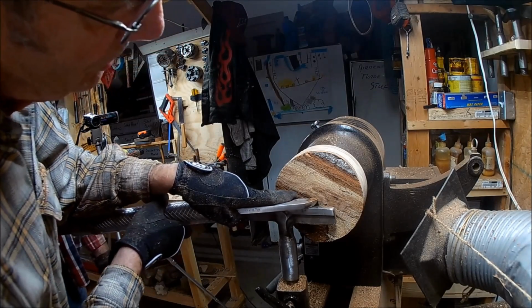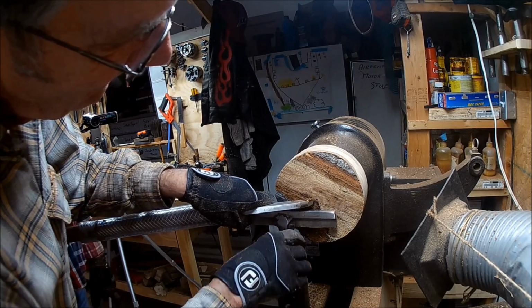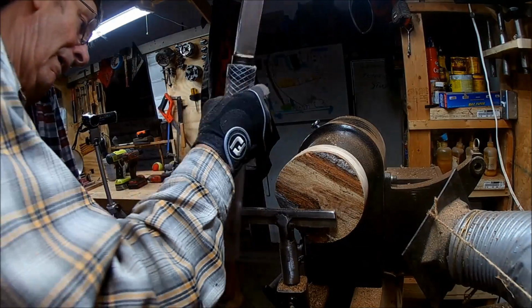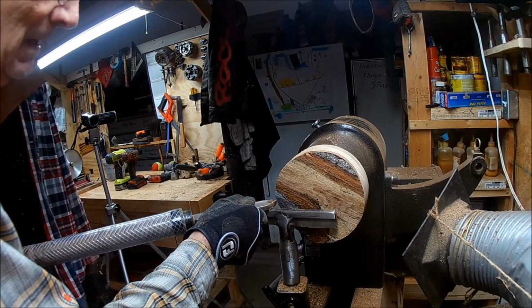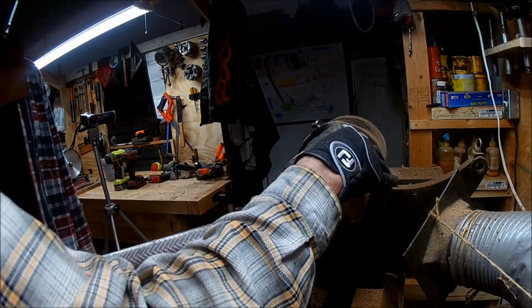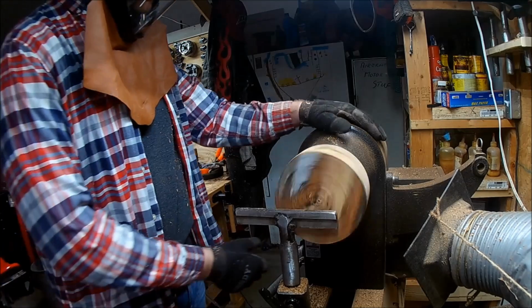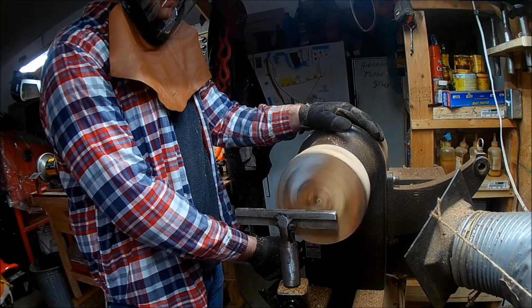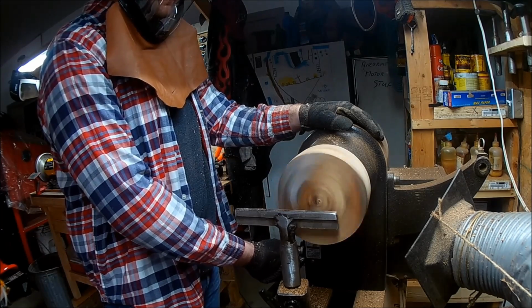In fact, your tool rest is just a little bit high. You're down just a hair. Right? Come on now. Right there. So you want to just see now it's about center. You want to bring it in right here and back. Because now this becomes over here. See? Okay. So you were here. So what were you doing? Yeah. That won't work. Gotcha. All right. Go ahead. You got to make the mistakes, you know. Learn by mistakes if they don't kill you.